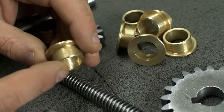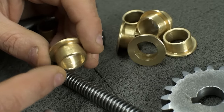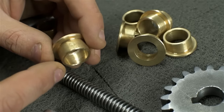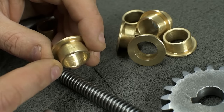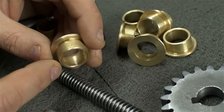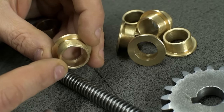At first, I thought I'd build this with bearings because of the cool factor, but bearings don't really make sense here. Bearings typically are for high speed and low load, at this size anyway. Small roller bearings want to go fast, but of course you can get them at any load rating you need. They get huge, of course, and expensive, but they make bearings for just about any design requirements you might dream up. Bushings, on the other hand, are usually for low speed and high load.